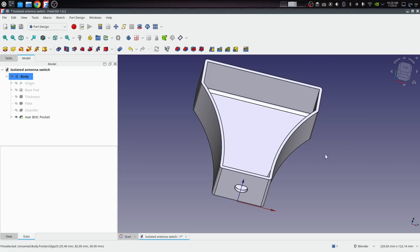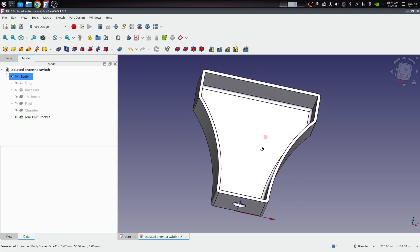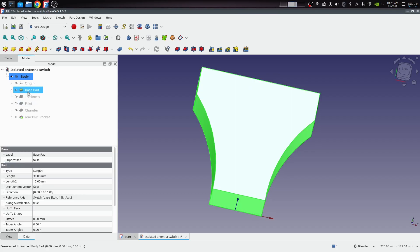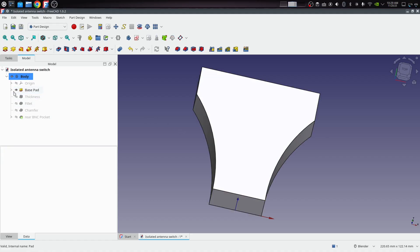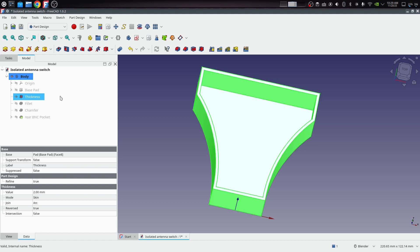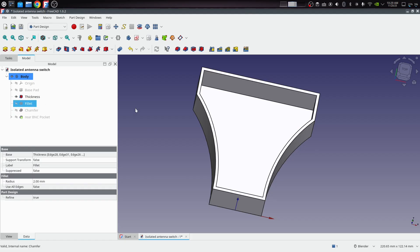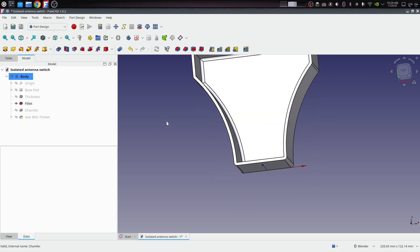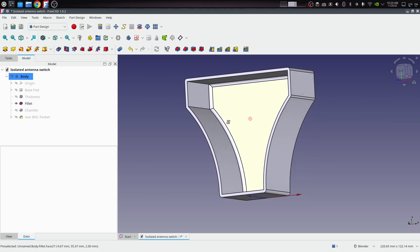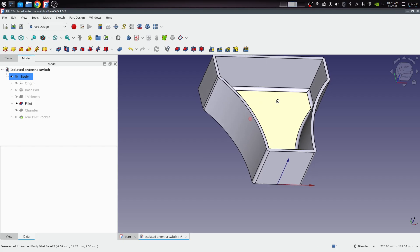While I'm working away on the switch housing, you can see I've got my basic shape as drawn out, and I've modeled the shell so far — fairly straightforward. I started with just a simple shape dimensioned as drawn on paper. I don't usually use the thickness operation in FreeCAD because it tends to be a little twitchy, but with basic shapes like this it works, so I used it to hollow out the shell. Then I went ahead and used the fillet operation to give a little strength on the inside edge with a two millimeter fillet, and also applied it to the outer corners to round them off.